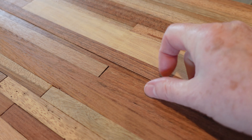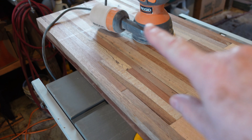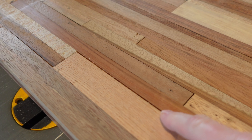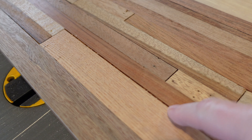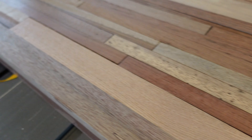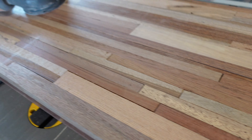There's quite a ridge right here. We're basically going to use the dust from the little palm sander and mix it with glue to fill the holes. These are a little bigger than I had hoped — we kind of messed up here. This piece should have been shaved down more at both ends, so it left too big of a gap. But we'll just have to fill it.